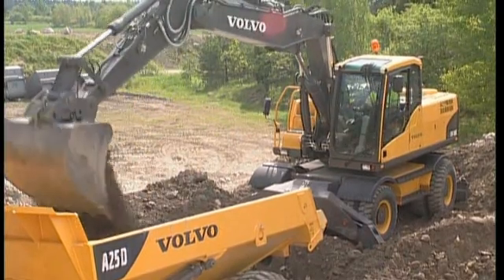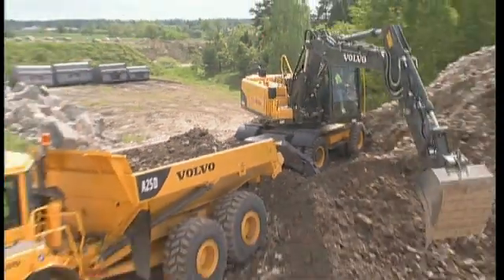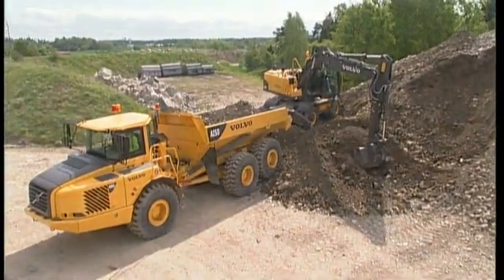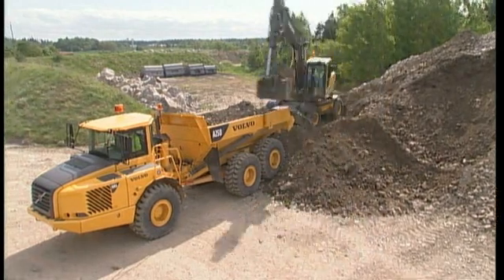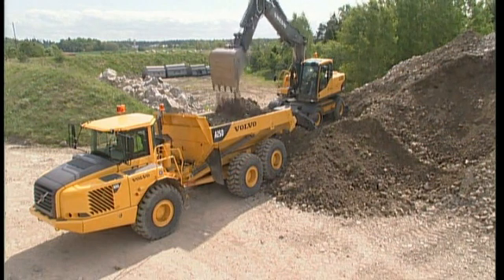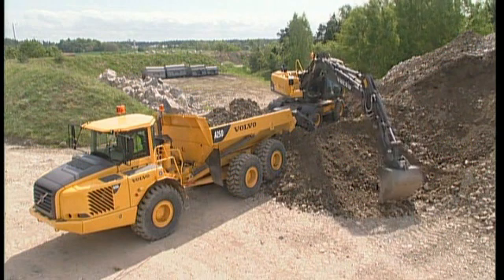To achieve the best performance, always try to be positioned above the vehicle onto which you are loading. The truck should be positioned in such a way that the shortest possible slewing angle is being used. For increased efficiency, it is important to have the boom at a low lifting height and to use a short slew. Lower the undercarriage supports to achieve the best possible stability.